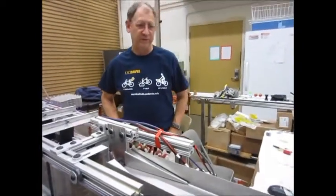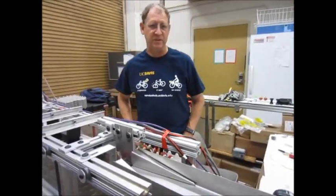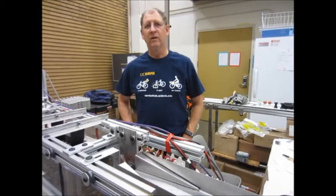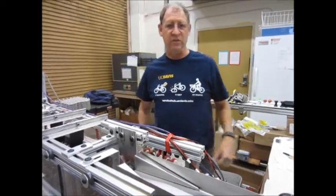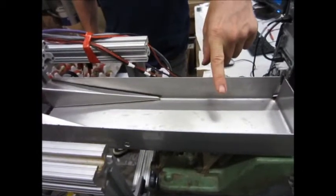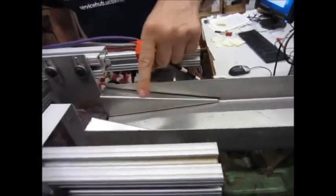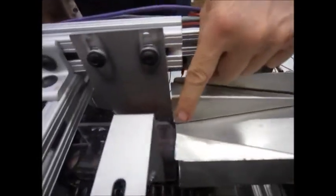It's capable of cutting over 7,000 pounds of strawberries in a 16-hour workday. The way the machine works is strawberries are dumped into a feeder. This is a vibratory hopper. At this end, they travel along that hopper and fall onto a paddle wheel, which we call the singulator.